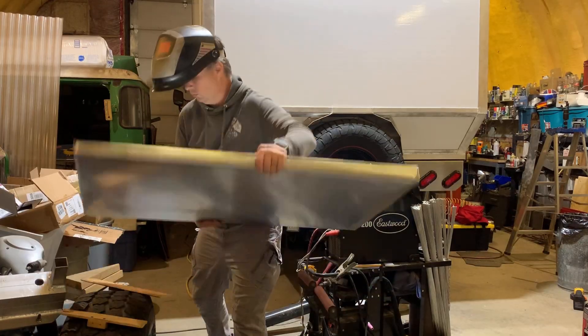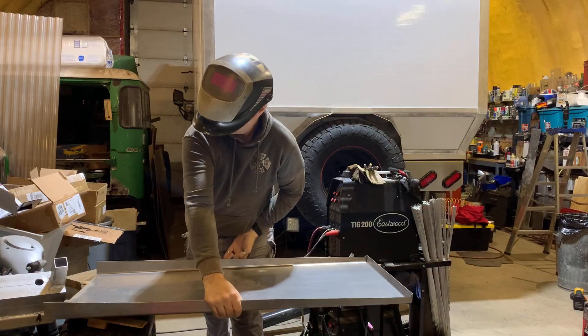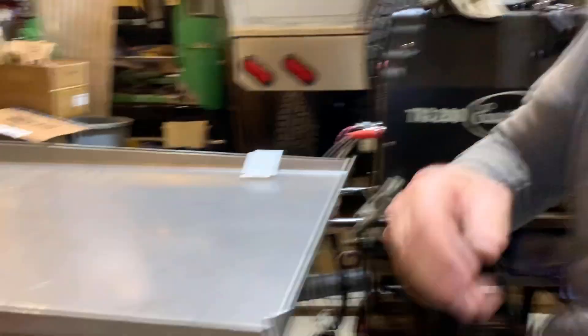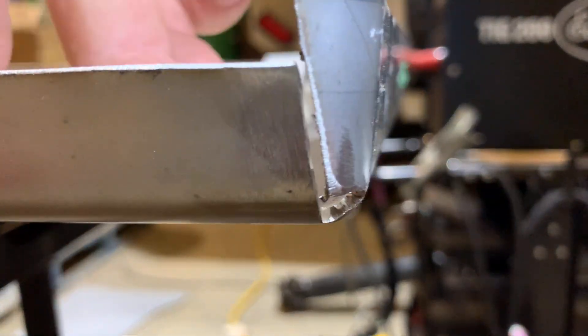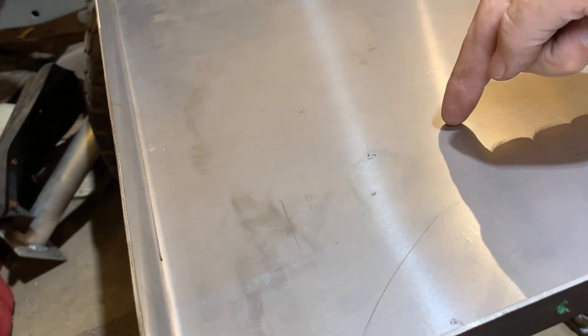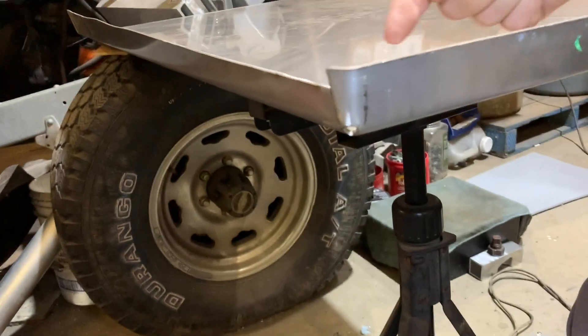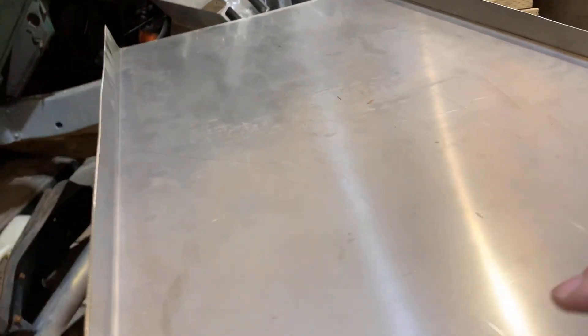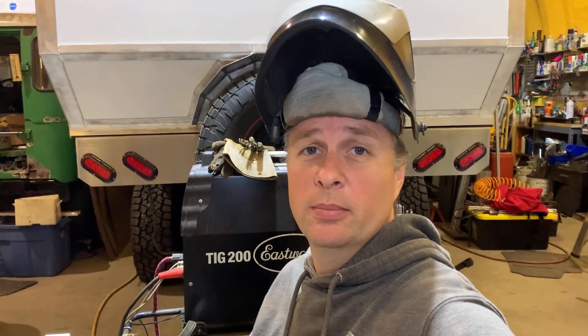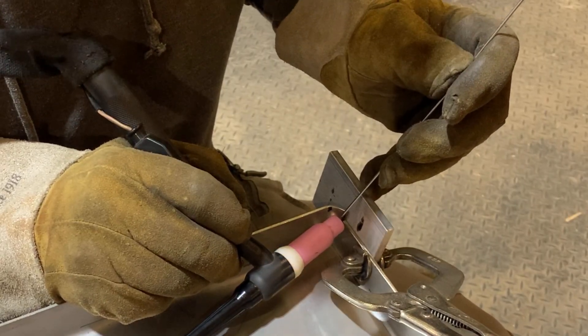Just need to do a quick flip of the part on my workbench. There's going to be a bit of an issue — great concept, love the idea of not using filler rod, but as you can see it didn't quite get a close enough fit-up, so I'm going to have to use filler rod. The other thing is I'm going from welding on the flat to doing a vertical up weld — heat is going to travel faster because on the flat it spreads out evenly, but heat rises. Cross your fingers for me; I've only got one shower pan.